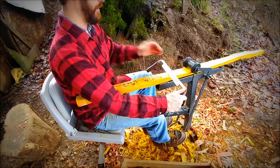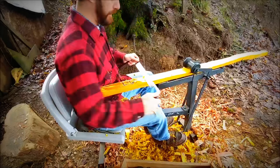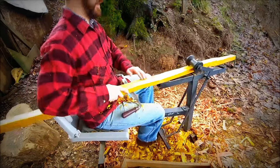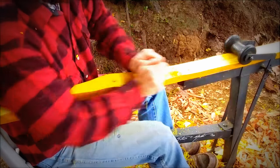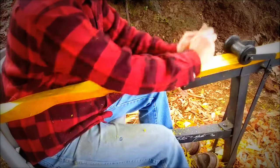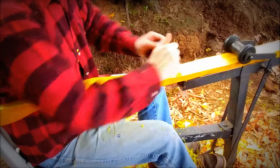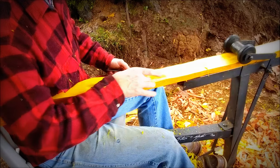You can see how aggressive I'm able to be on most of this — I'm just hooking under that crumbly wood and tearing out, and I can feel confident that there's nothing that's going to catch and dig down into the solid late wood back that I'm trying to maintain. It's all just going to skate along that and tear out. I'm just cleaning up the back now, digging out the areas that have the concave back.